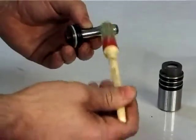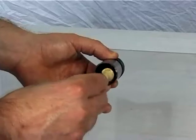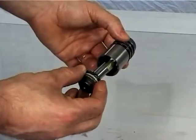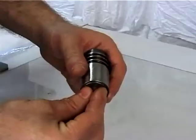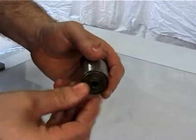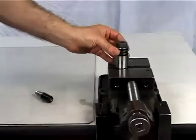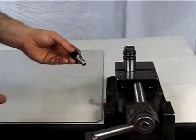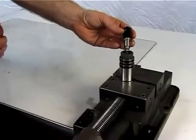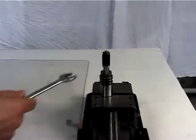Grease the piston, figure 24, and the oil dynamic cylinder, figure 26. Then proceed to assembling them without thoroughly inserting the end of the piston, which must be clamped in an adequate vise. Apply Loctite number 542 on the thread of the cone holder and screw it on the piston, blocking it with a 17 mm wrench.